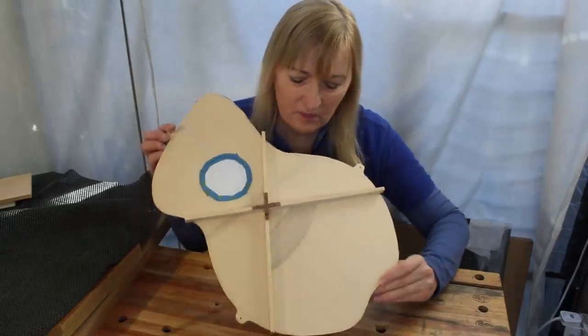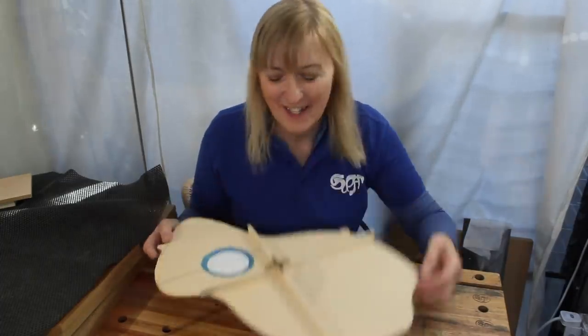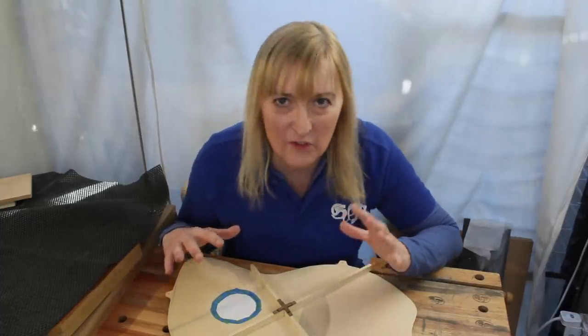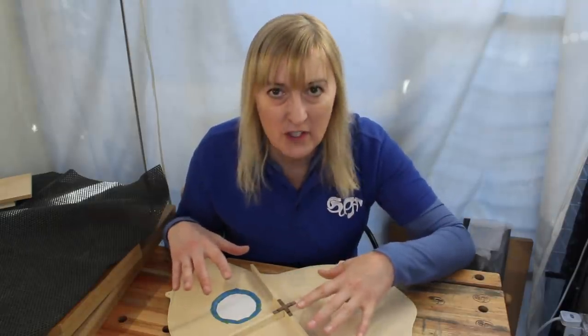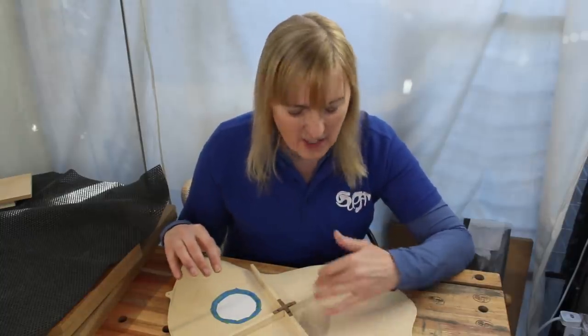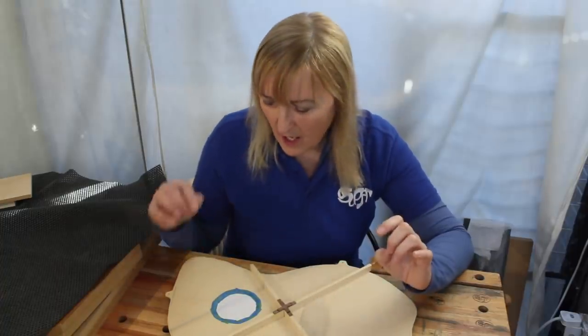Here it is. I love my bridge plate. That's really nice. I didn't leave it overnight for the glue to dry. The glue probably only got about 3.5-4 hours for the X braces, and three and a half hours for the bridge plate. But I think that was okay.